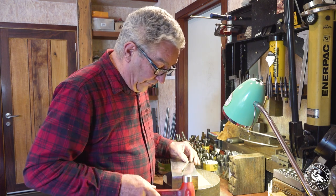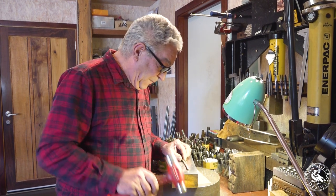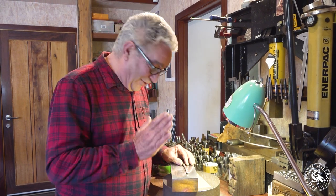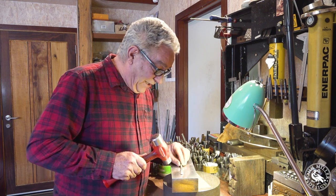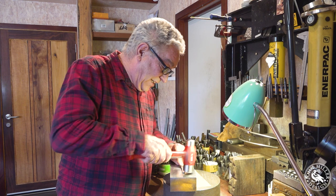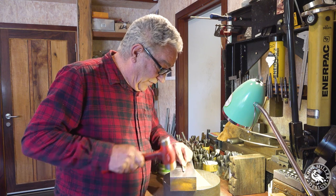It's going to go a bit silly — there are a few rules we have to follow here. I might come around with a slightly rounded profile hammer. Rule number one: always be working it back to straight. What happens is if we beat on one side, it will bend around that way. So then we beat on the other side, it will straighten it up again. Always be hammering on the inside of your curve if you've got a curve.